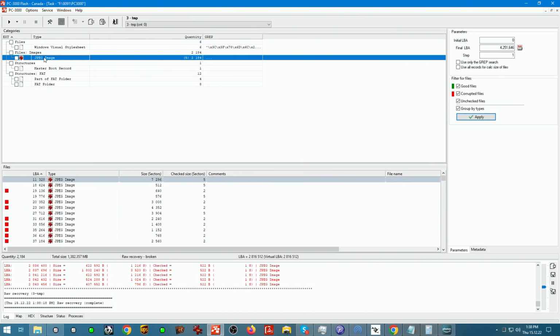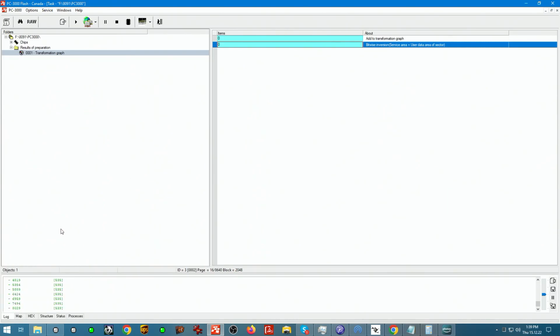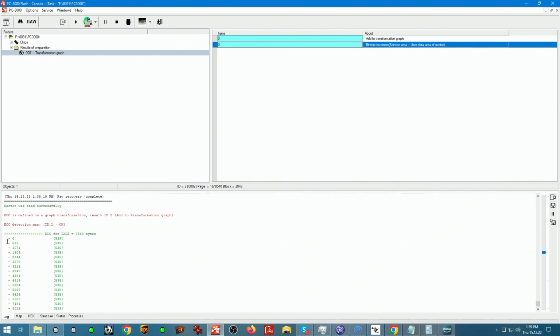This is again an older card. We don't know what specific controller it carries yet, because we can't run XOR validation. We can't just assume that it's something, because nothing is written in regards to the controller on the PCB. If we go into tools and ECC and view our ECC information just to refresh our memory, it gives us these ranges.